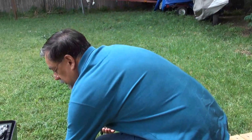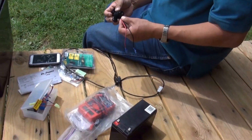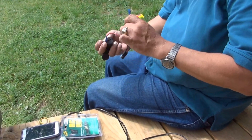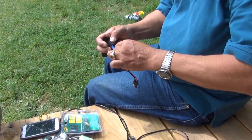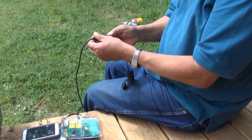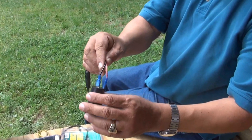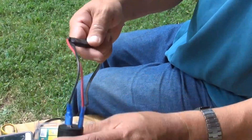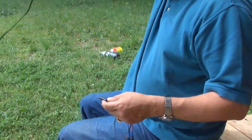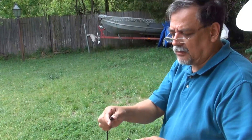Just be careful when you take it out — this is kind of sensitive. You connect positive to positive, but you have to check it out because it may be inverted. I got the positive red wire on the negative terminal. Don't ask me why — somebody screwed up and it wasn't me. The black is on the positive, the red is on the negative. This is the cable from the 12-volt five-watt solar panel from Harbor Freight tools — these people have it backwards.